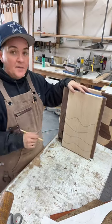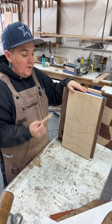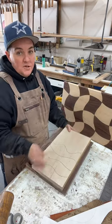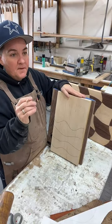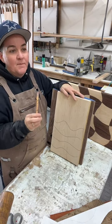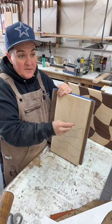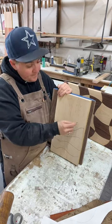I mean, you don't have to have a planer. You could have a belt sander. If you have wood, a way to cut wood, a few clamps and some glue, and a sander, you can pull this off without any machinery. This here. Oh, sorry. You also need either a bandsaw or a scroll saw. I would not recommend a jigsaw. The number one thing I would use to cut these out with is a bandsaw. You can find them even for the big shop ones like I have. It's a stand-up, called a 14-inch. I only paid a couple hundred dollars for it.